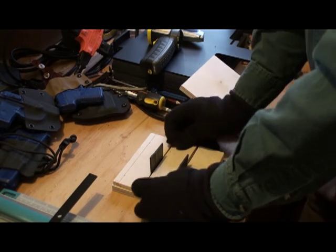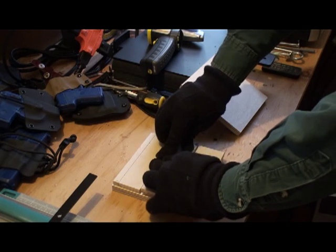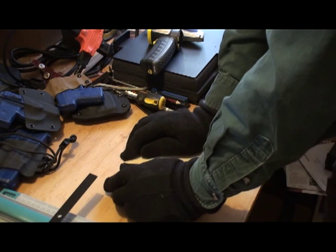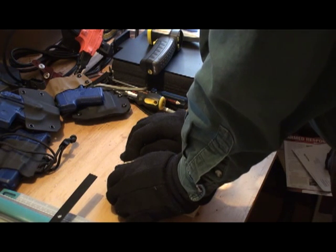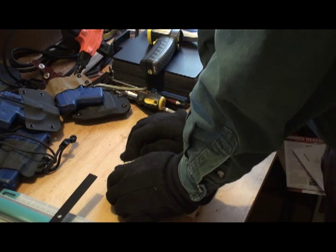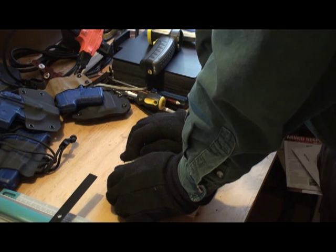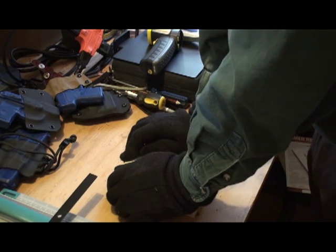Press down, bring this piece down, kind of get a little start to it, put some pressure on it. Can't do it too long because it's hot. I put this right over the top of it and press. I think about what I'm going to have for lunch and pretty soon that rolls into thinking about dinner and the thinking process just goes away. I'm sure if you had a clamp you could put a clamp on this and walk away, but kydex has a tendency to cool down pretty quick.